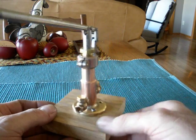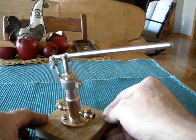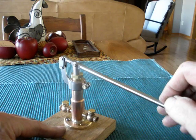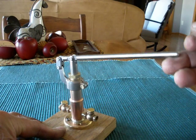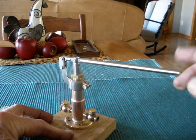I have to disassemble it and paint it. Other than that I am calling it complete. I have tested it up to 150 PSI. I did that just a little bit ago to make sure that the gland wouldn't weep.